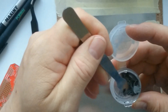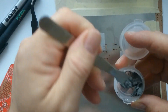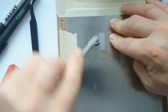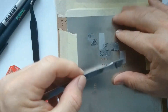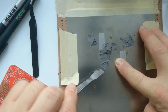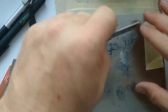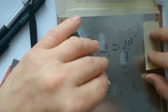Then it's time to open the package and unfortunately, I didn't really take care of my solder paste. As you can see here, it's kind of rock solid. Despite that, I used a metal tool to apply the paste. I kind of push it through the holes, working my way to covering all the holes, trying not to make too much of a mess. I probably added a bit too much solder paste, so at the end I used the nicely supplied card to remove any excess paste, hoping that didn't leave too much paste beneath the metal sheet.